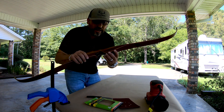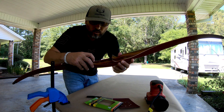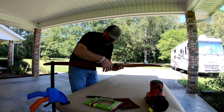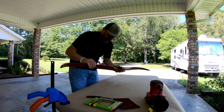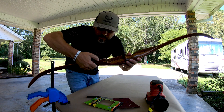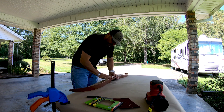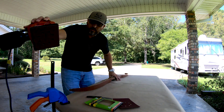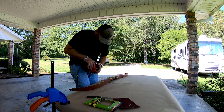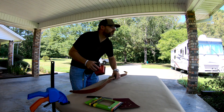You can see, man, it's pretty rough. It's got a lot of cracks and stuff on it, but it looks like it's all on that outer surface of polyurethane, that clear coat they put on it. So I feel like it's going to be fine — it's just chipping away. So when we start sanding this bad boy, she's going to get to looking pretty good. We're going to start out with 80-grit sandpaper and work our way up to like a 220.